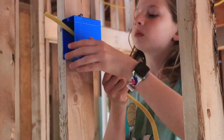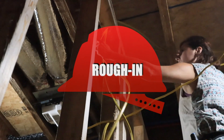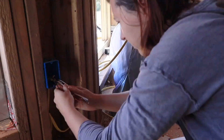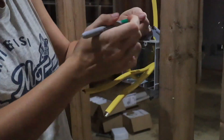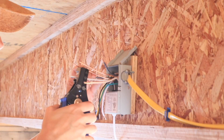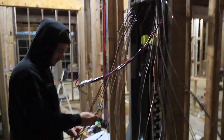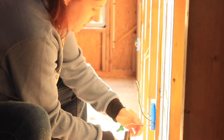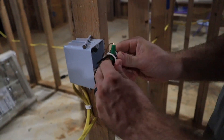Alongside that inspection, we could go ahead and get our rough-in inspection. This is the inspection where the inspector is looking at all your wiring — what gauge wiring, all your nailing systems, your staples, the holes that the wires are going through, things like that. He's looking at your panel and how you got your wires ran, breakers, things like that. And this is obviously done before sheetrock.